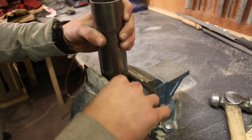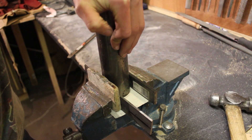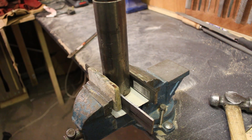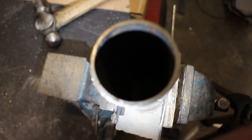You basically want something circular that you can pour aluminium into — you can use a steel coffee can for this. It needs to be steel or above the melting point of aluminium, and it's easiest if it's a hollow tube that's very smooth on the inside so that you can hammer it out afterwards. As you can see, I've just got a piece of scrap steel in a vise pressed hard against some firebrick so that it creates a watertight seal on the bottom.